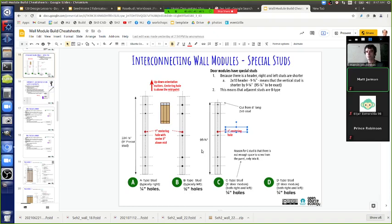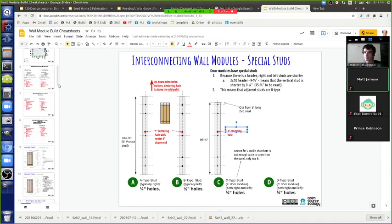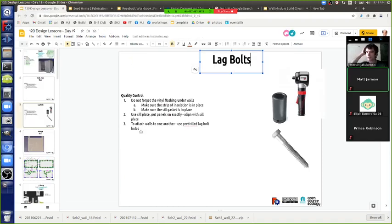These are considerations from practice: panels may be off, and if it's as little as half an inch off, the lag bolt holes won't align. In order not to fight it, we have to follow a rigorous procedure. That procedure starts with the foundation already in place. The most logical idea would be to put in the bottom lag bolt first.